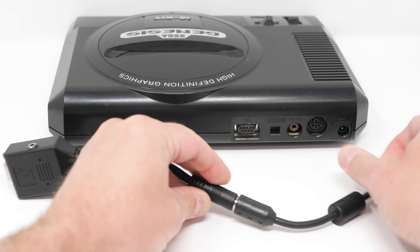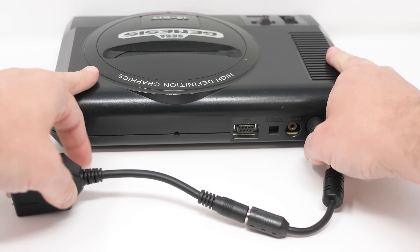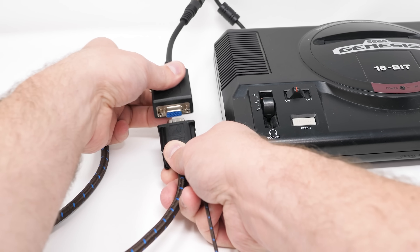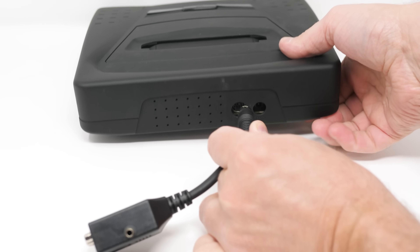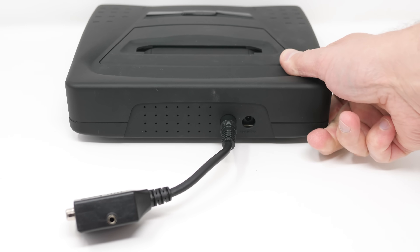Same with the Genesis 2 version — it'll work with all Genesis and Mega Drive consoles that officially came with that port, and it'll also work with Genesis 1s via a separate adapter, and any mod that uses the Genesis 2 Mini-DIN, provided the mod was done properly. If your modded consoles work with standard SCART cables from the main manufacturers, then these should probably work too. But if you have some crazy mod done to the multi-out, or one of those PlayStation C-Sync mods, or especially anything that requires a custom cable to match the mod, then these or any other standard cable probably won't work.